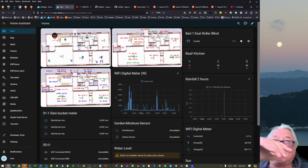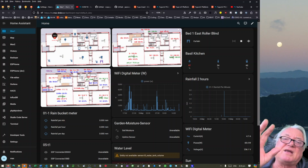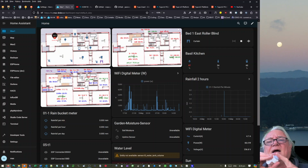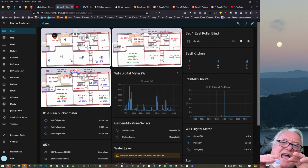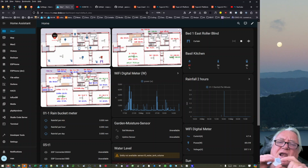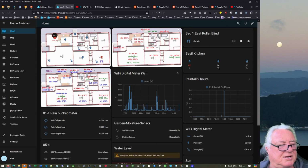And I can have the condition that it's after dusk and before dawn or whatever, but it can also work in the daytime. So if you have a dull day, it'll just give you a bit more lighting. This is where light meters, or lux meters, are good for those ambiguous spaces. You have a small room and it's not orientated, it gets a little bit of borrowed light from another room, so sometimes it's a little bit too dull. So just saying dusk and dawn doesn't quite work, so you can use a lux one to actually trigger in between. So I just wanted to mention that.